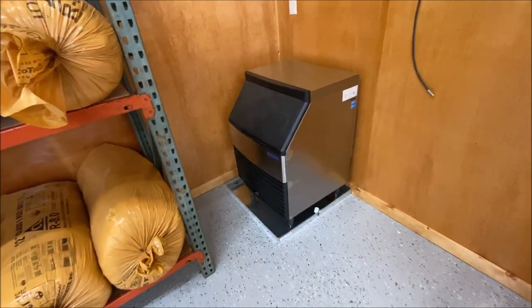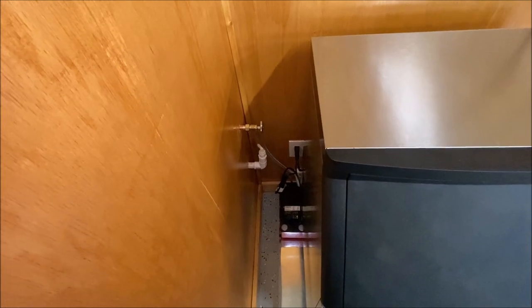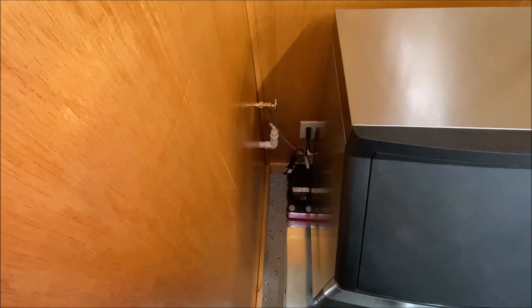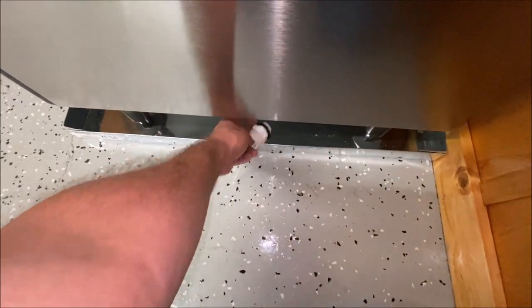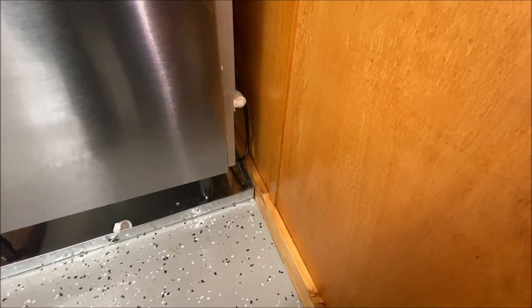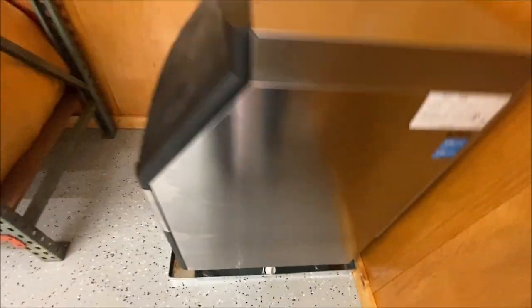All right, here's where I'd like to have a couple of ideas from some of you guys that have some refrigeration experience, and I know a lot of you do, and I actually do not. What would you do to protect the failure and water damage situation here? So obviously I can plug this pan, and I'll do that. Obviously we can put a float switch that allows 110. We can put a float switch to the pump over there, the failure float, to where if the pump overflows and doesn't pump out and it hits that top, you know, everybody's seen that.